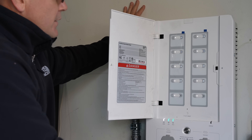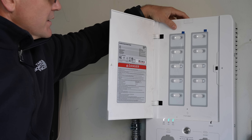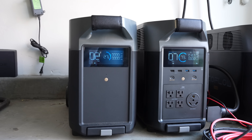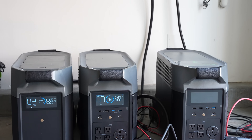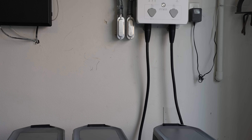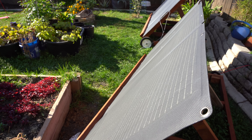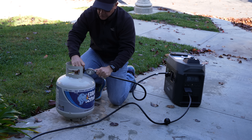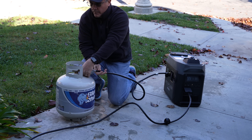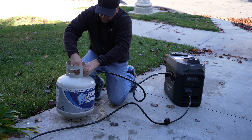Whole Home Power Backup. Let me start off with a high-level overview of this specific setup and the heart of it, the Smart Home Panel or SHP. The SHP is EcoFlow's newest addition that allows you to tie their Delta Pro into your home's existing electrical panel. If the grid goes down, the Delta Pros will instantly provide power to select lines tied in with the Smart Home Panel. Two Delta Pros can be combined with up to 3,200 watts of solar panels and connected to EcoFlow's dual fuel generators, which can be programmed to automatically kick on when Delta Pro batteries drop to a specified amount, programmable in the app.